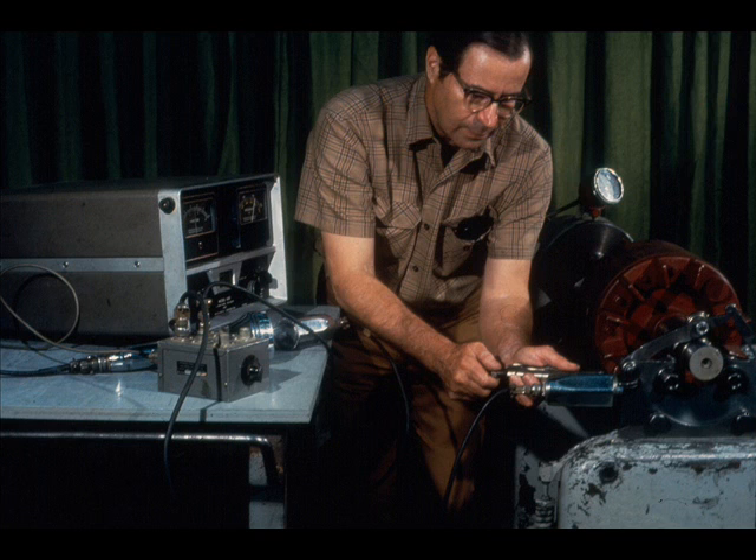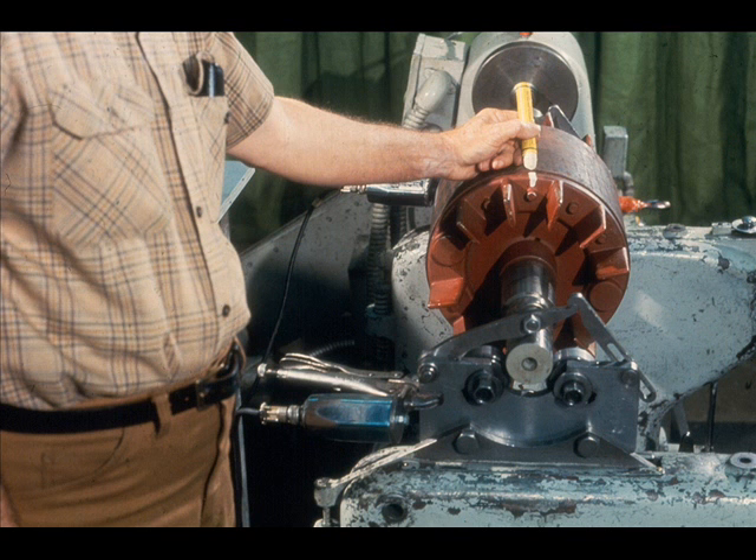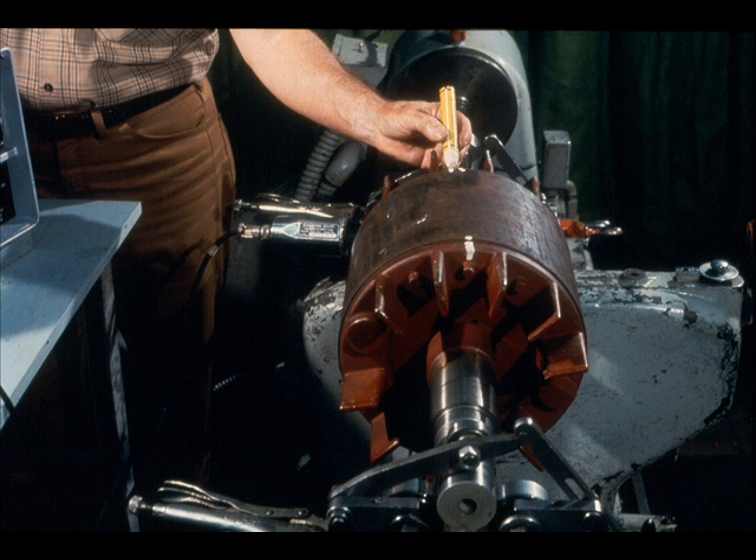When you have finished the test, attach one of the pickup probes to each of the two bearing brackets on the carrier. They're being attached in a horizontal position, since this will enable us to record the greatest possible displacement during our checks. Make sure they are tightly secured to prevent additional vibration. Now use a paint stick to make reference marks on each of the two planes to be checked — one on each end of the rotor. Make sure they are clearly visible.